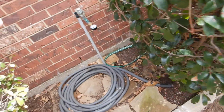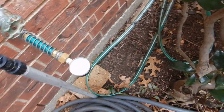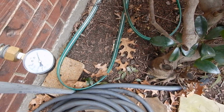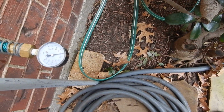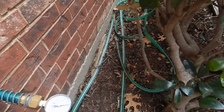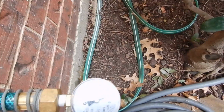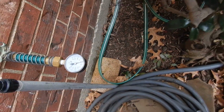This is the closest valve to the street. And you already noticed that this one, the vacuum breaker is leaking, but it's still the closest valve to the street, to the meter. We're looking for between 40 and 80 psi. Alright. Well, it's not leaking now. How about that? Okay, we got a little over 80 psi. And we need to let this set for a couple minutes. Alright. So then we're going to carry this on.